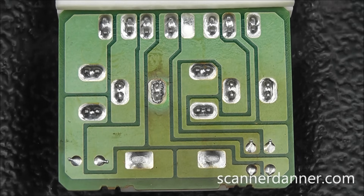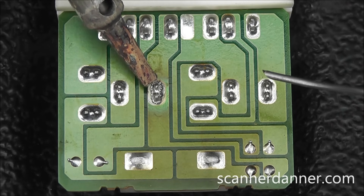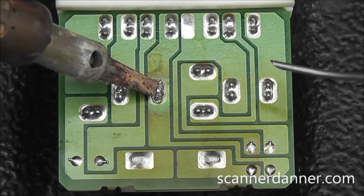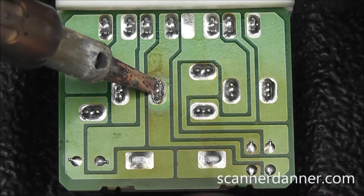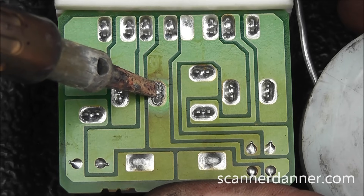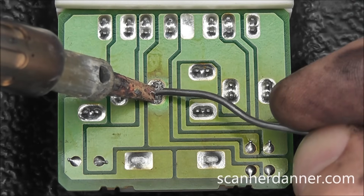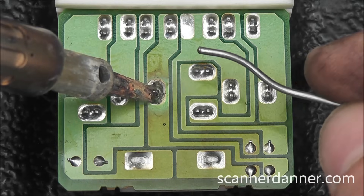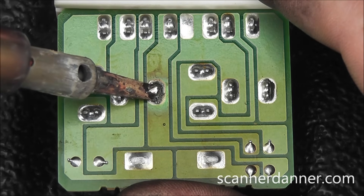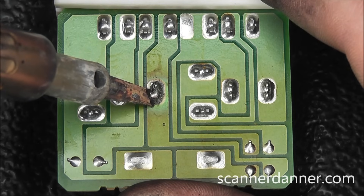Got the soldering gun very hot — that's key. Using a butane soldering gun; I'm in the field in a parking lot. I'm going to heat the pins and the solder joint itself. Sometimes you can do this without even adding any solder at all, but it's kind of hard here. What we want to do is see that solder melt across the terminals. It doesn't take much. I want to get a little more on the board itself and make sure I have a good set on this board.